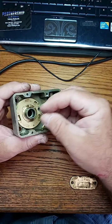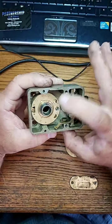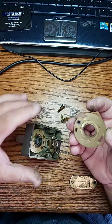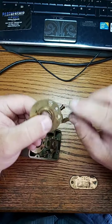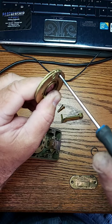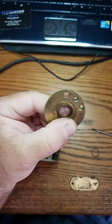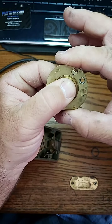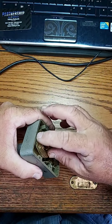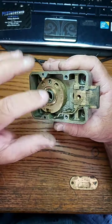We then go ahead and put the next one on there. If you have a safe at home, this is what the inside of the lock looks like — if it's this brand, naturally. We're going to make sure this one is locked in — which it's not. You can see it's off right there. We turn it back to the correct position using our change key, and now it's locked in. You see the arrow right there — this will not turn now, and that's what we want. So we stick that back on, and there you have your wheel pack.